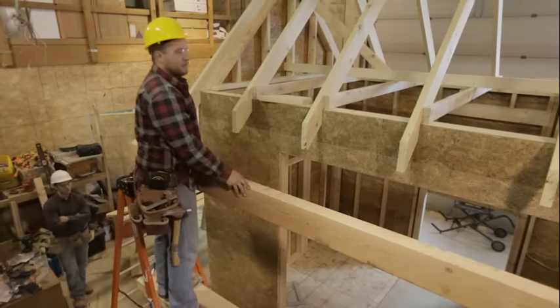Go down just a little bit. We took a lot of time cutting all these rafters and leveling our wall and getting it straight, so we know these reference points are pretty straight. We're not going to rely on the straightness of the board because over a 16-foot length we could have about a quarter to a half inch of bend to that board. So we want to bring it into place using the rafters as a guide. These two look pretty decent, so we'll talk about how we'd finish nailing this off.